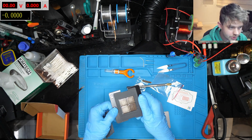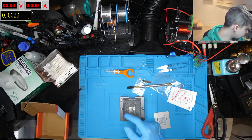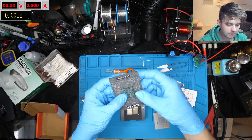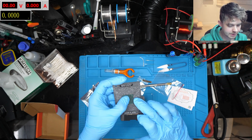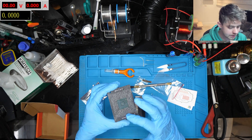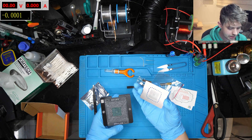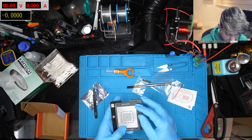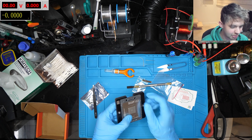Here is what I mostly got this for — this nice strong magnet base, and this attachment in particular is for the Switch. You put these right above the magnet, grab the Switch APU we've been working on, and it just fits in here super nicely — it's recessed so this fits perfectly into this little slot because the adapter is designed for this particular chip. You can buy different adapters for different chips relatively cheaply. Then you pop the whole assembly on the magnet, and the Amao BGA stencils fit perfectly. This magnet is incredibly strong — I see why people like this thing.